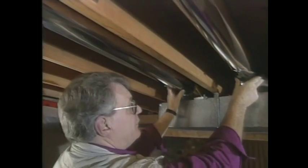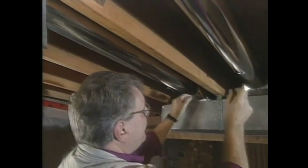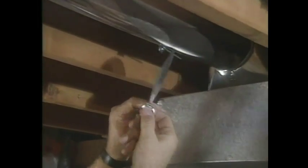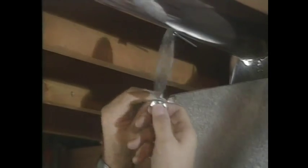As you can see here, the ducts are in a row, but also the duct dampers are in a row. That's not always the way they should be, because inside that duct the damper can either be fully opened or closed, or whatever position is required in order to deliver the correct amount of air.